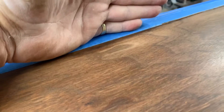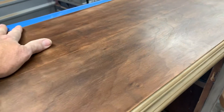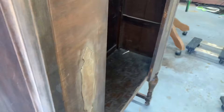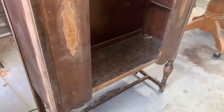I put this piece of tape underneath here because underneath this tape is where that decorative inlay goes, and it's the original color underneath there. I need to keep that perfect so when I match the color I can use that to go by to get the original color. I'll do a test piece on the back side to make sure I can get it exactly right.